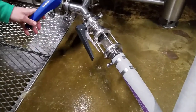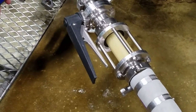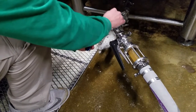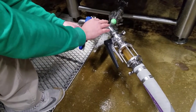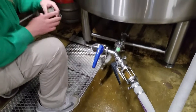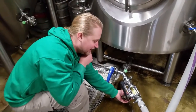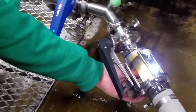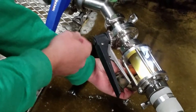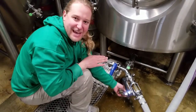Walking this line — you'll see it starts changing, so give it a second, and then go ahead and catch that into the bright tank. There are a couple of chunkies. Now we'll let this whole system balance out. The best way to look through sight glasses is with a flashlight — put the light on the back side of the sight glass instead of the front, and then you can see how that liquid moves. Once the liquid stops moving and the system is balanced out, then we'll turn on the pump. That's how to get this pitch-and-catch contraption going.